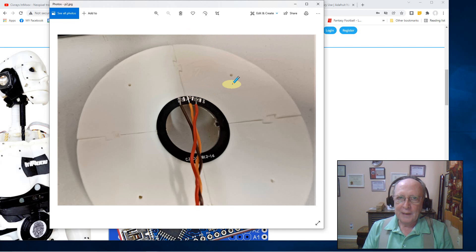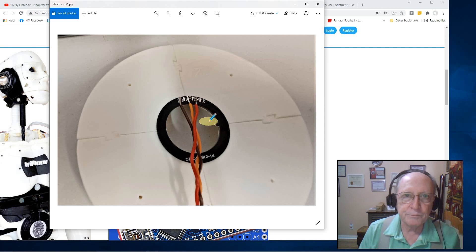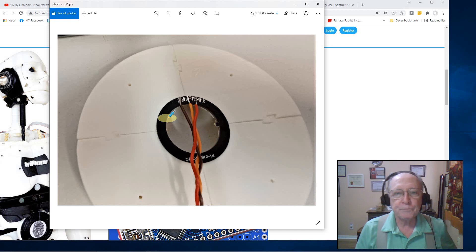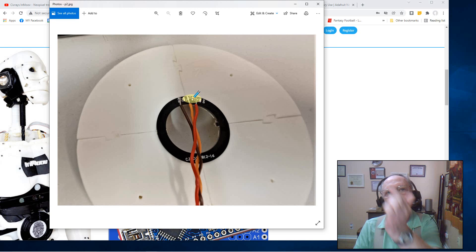I have a bad tremor and I'm an old man, so working on these tiny little solder plates is not an easy task for me. I'm doing things a little differently than Steve — Steve will show you how he mounted all of his circuitry right in the ring, which is a nice way of doing it, but not for me. So I've soldered my wires on here and I'm going to put all my components remote. That gives you a second choice to consider. There are three soldered plates right here: D-in is the control wire, VCC, and ground. Then you have D-out for daisy chaining, VCC, and ground.